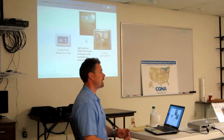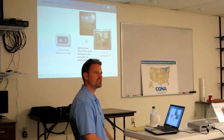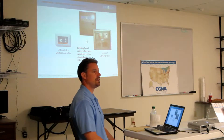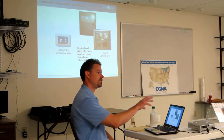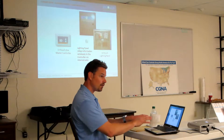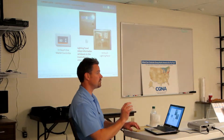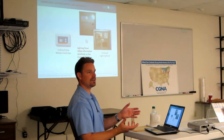So we're now coming out with lighting control as well. It's simple lighting control. A good way to think of this is it would replace time clocks in a commercial facility. You could control four relays with this. It's going to communicate internally on our own network, and gives you the ability on the web portal to schedule your different lights, on/off times, be able to see if they're on, and be able to turn them off if you wanted to.